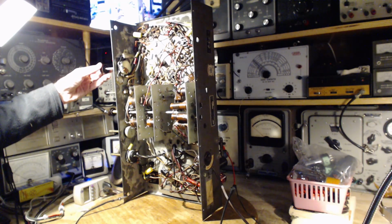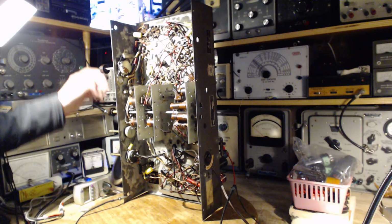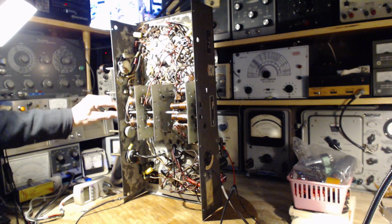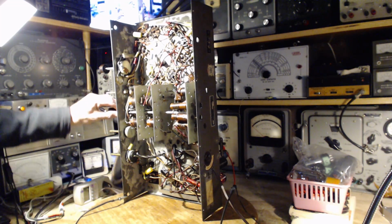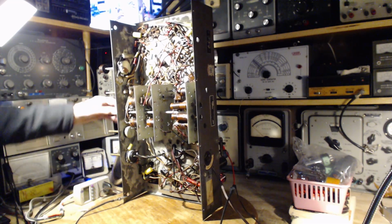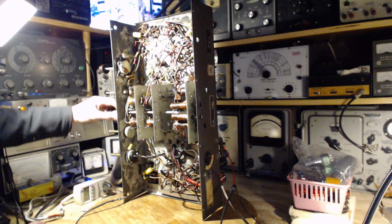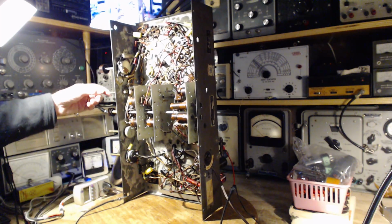Next one. Something going on there. Next one. I wonder if it could just be that this head is out of alignment, and that's preventing the oscillator. So this is potentially the weak band. It's really not very convincing, is it? If there's a weak one, that might help me source the problem. I could find the sensitive spot. That could be a great advantage. You know what? I'm not really hearing much action here. There's another way of checking for the local oscillator, which I will do next.